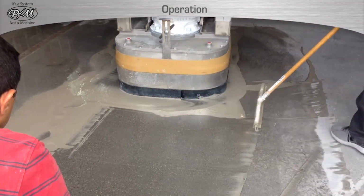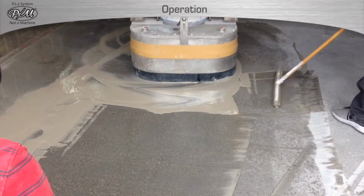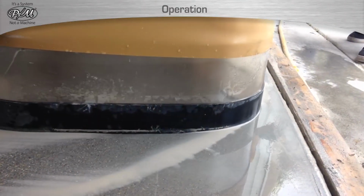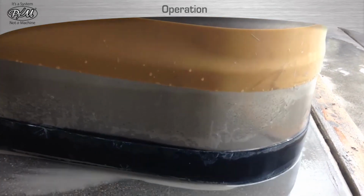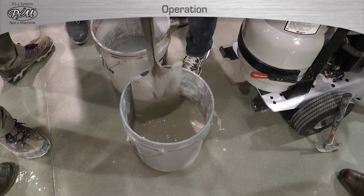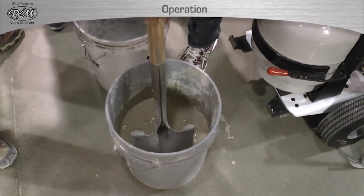It is completely acceptable to reuse the slurry as demonstrated, but only for the duration of any one step of grinding or polishing. At no time is it acceptable to reuse the slurry for differing grinding or polishing steps. The reason to not reuse the slurry is due to the expelled diamond chips in the slurry and other contaminants.